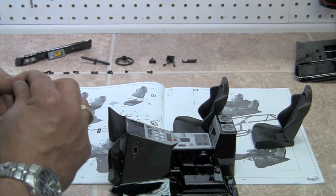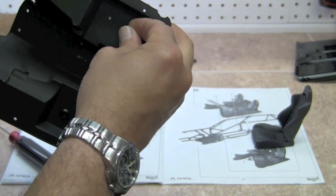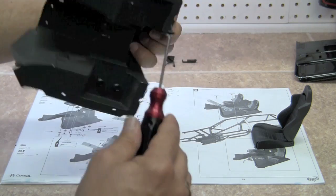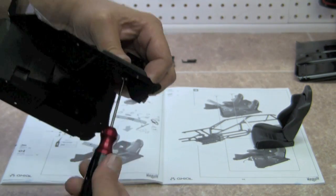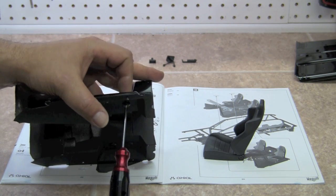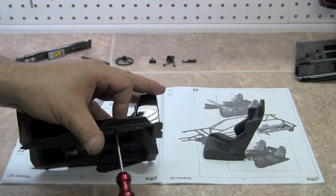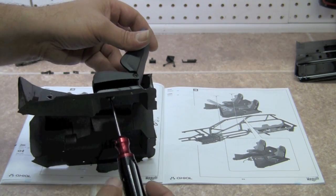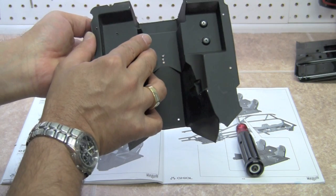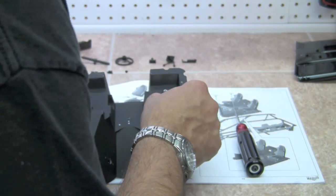It's just a little bevel washer. So I'm going to take the longer one towards the back, we're going to put the bevel washer over. I'm going to slide this up through the hole that we've made — actually, we're going to screw it into the hole. I made my holes a little bit smaller than the screw, which is a good thing. The thicker, longer screw goes towards the front, so we'll put that in again. Line that up and bolt it in — you don't need to crank on it, just until it touches and it's snug. We're going to align the second hole up from the back, and I have to say the alignment nubs that were given to us in the plastic line up very, very well.